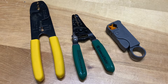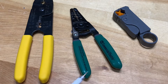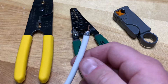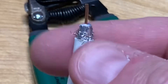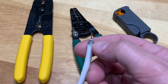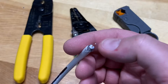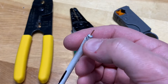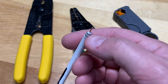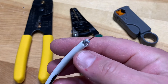These tools are not really meant for the professional installer — pros use tools that are much more sophisticated and expensive. Any stripping tool you use will work fine as long as it can perform a two-step cut. The first cut removes the outer white jacket and exposes the braided shielding wires. Beneath that is a layer of foil wrapped around the white inner core, known as the dielectric, which insulates the center copper conductor that carries the TV signal.